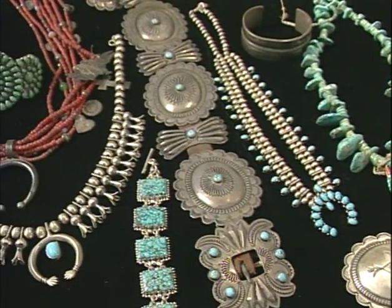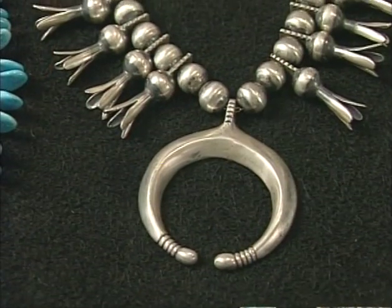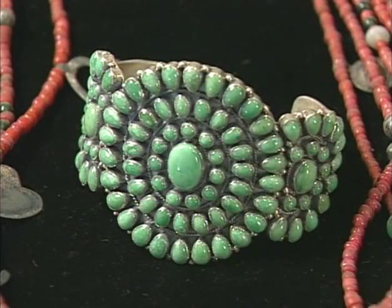I was really influenced by the Navajo and Zuni styles. The Navajo is pretty much straight silver work. And the Zuni is a lot of stone setting. Everything is all fabricated, and that means that you start with sheet or wire or whatever, and you make all the little parts, solder them all together, saw it out, buff it, whatever you have to do, set the stones.